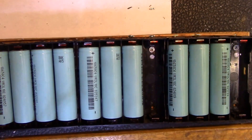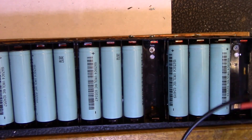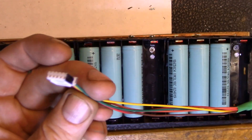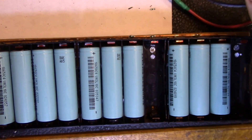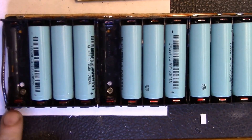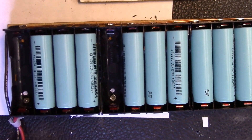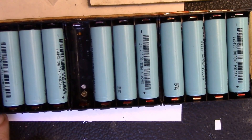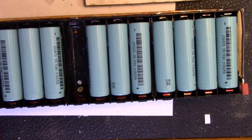Here's my new balance cable. I'll solder the red and black wires onto the bus wires to create a balance cable connection. It's a 4S cable but I'm only using the first two positions. There we go — I've got my plus and minus balance cables on there with a little cable clamp to hold them in place. Now I've got my charging connection and I'm measuring voltage off the end. I checked voltage on all the battery contacts and I get the same voltage across all sides.